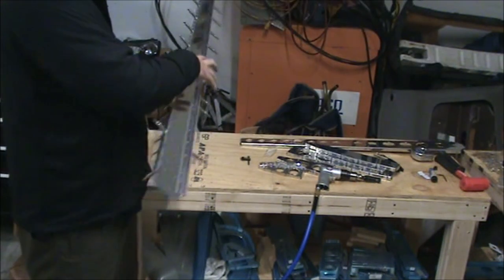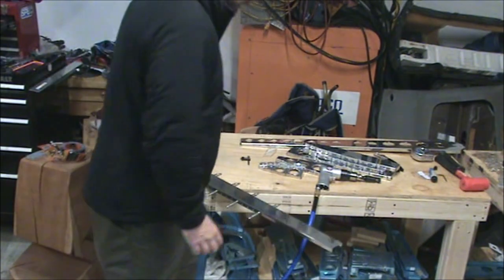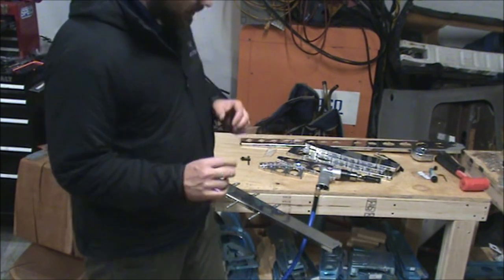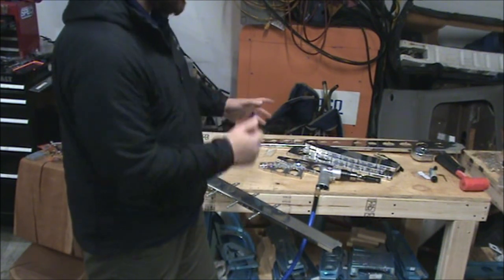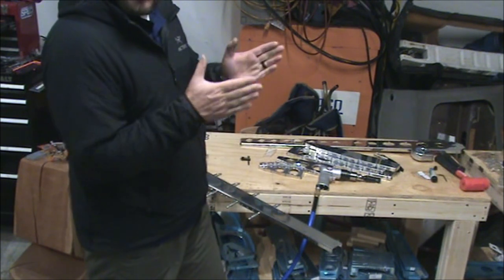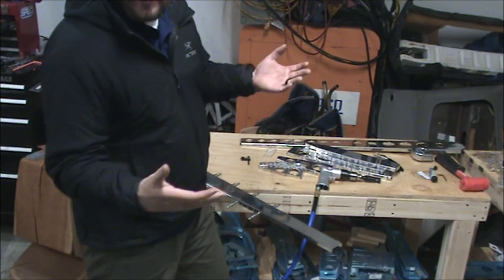And you saw me take a break there and come down here and check it. That's because even though I had set that tool up correctly as I was countersinking, it just seemed like I was going too deep. But checking out on the skin, I showed that the skin was fitting up properly. I backed it out one click or two clicks and tested a hole, and it didn't fit. I went in one click, it didn't fit, so I went back in the two clicks and it fit again. It just seemed like I was going really deep, but it turned out to be the correct depth.